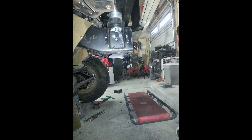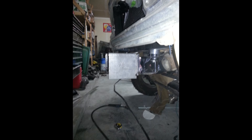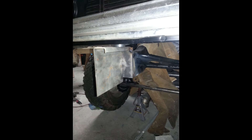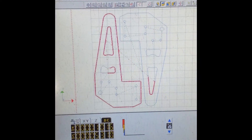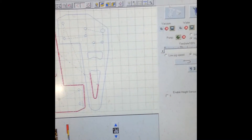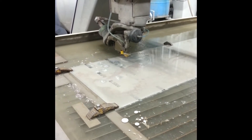Collecting all the parts for that took a little while, so in between bits and pieces of the transmission I started cutting on the frame horns — cut the ends off, replaced them with some homemade pieces, and also removed the leaf spring hangers from the front of the frame. All that to make way for these parts that I drew up and, with a little help from the water jet, cut out.